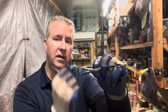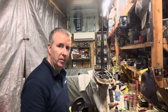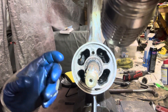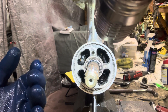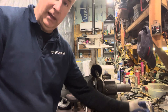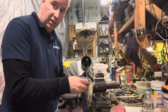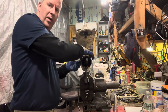This is going to have some thrust on it — when that motor's cranking and we're spinning that lower unit, it's going to keep some thrust on it, so we want to make sure you have the right play on this. This may be a two-piece shaft — I'll have to look it up in the book. You can see the heads of those bolts down in there — they screw to a ring, and then there's a big snap ring in there. So we're going to remove these bolts and then pull this bearing carrier out.